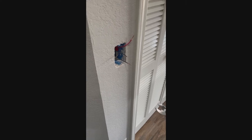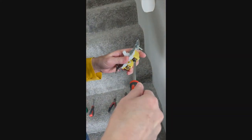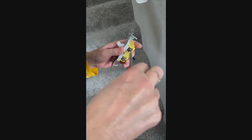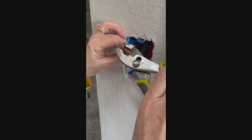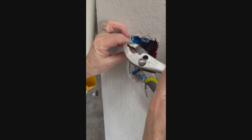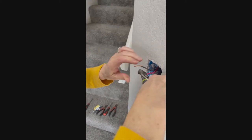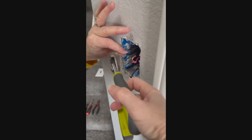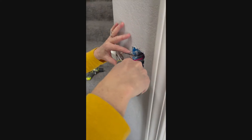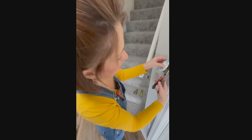After that, you can grab the rubber with the end of your pliers and just pull it off. Now we're going to make loops in our wires, and you want the loop to be going the same way that you would turn your screws to tighten them, which is clockwise. For the two wires on the right side, grab the wire with your pliers and pull up and over. For the wire on the left side of the light switch, twist down and under with your pliers to make that loop.